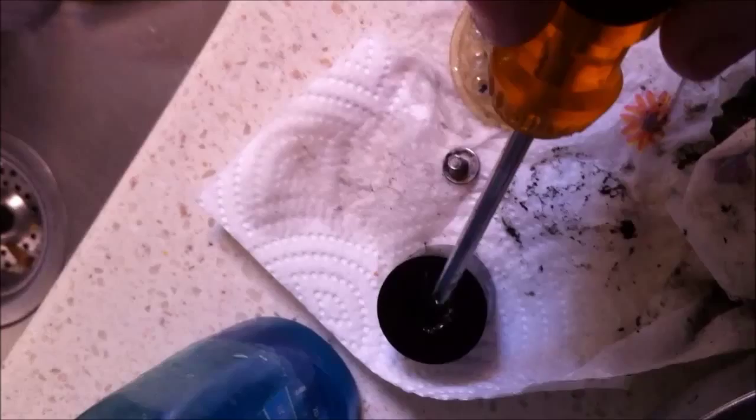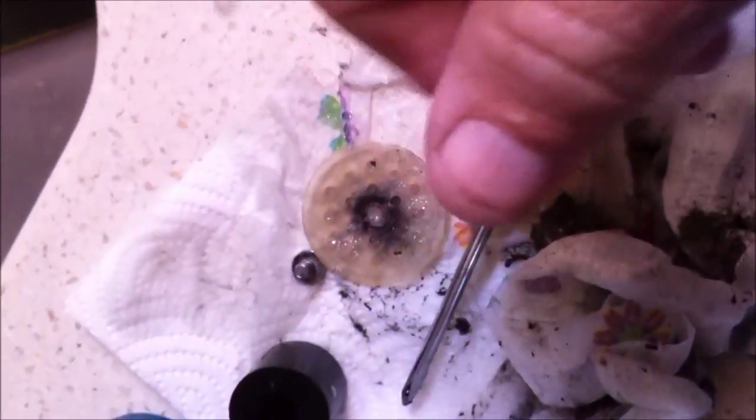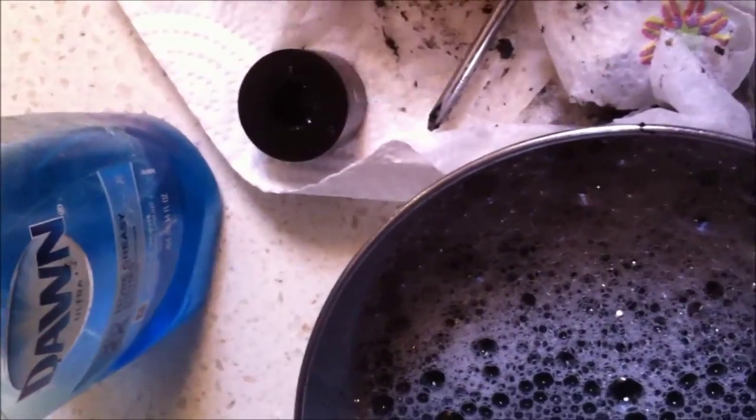You're going to need to use your screwdriver to kind of get inside the hole where a lot of the crud builds up, and that tends to be part of the problem — that it's not floating up on the shaft well enough. So the next thing we're going to be doing is getting back down into the hole and cleaning that out. I usually use a small amount of soapy water — Dawn dish soap — to clean these units off and get all that wax and oil and everything else that goes to your bilge.